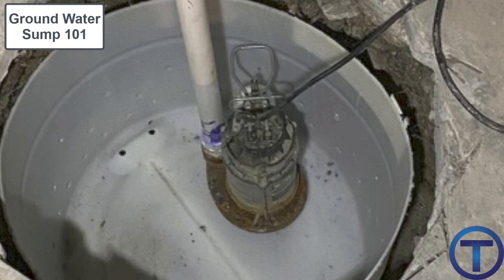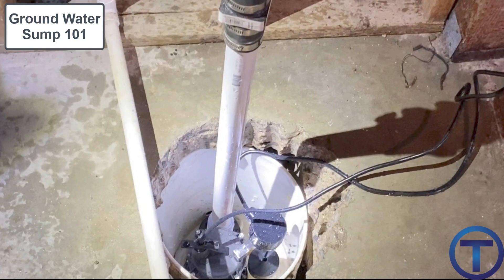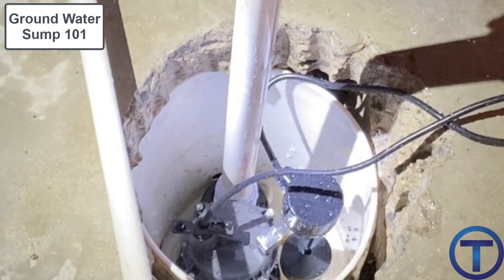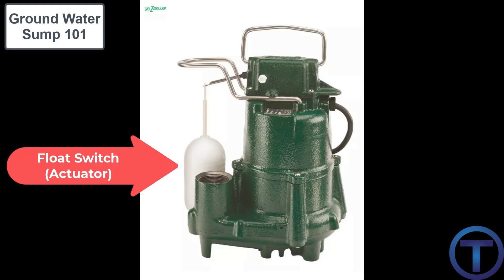The pump is set down into that tank below the floor, and its purpose is to lift the water out as it comes. If there's a constant stream of water from below ground, the pump may be working quite hard, so it's important to make sure it has proper capacity. Pumps are submersible and have an actuator — most use a float device. As the float rises with the water level in the sump, the pump kicks on, pumps the water out, the float drops, and the pump turns off.